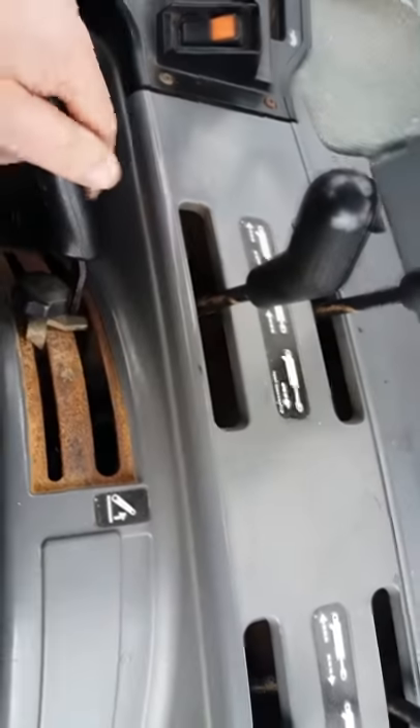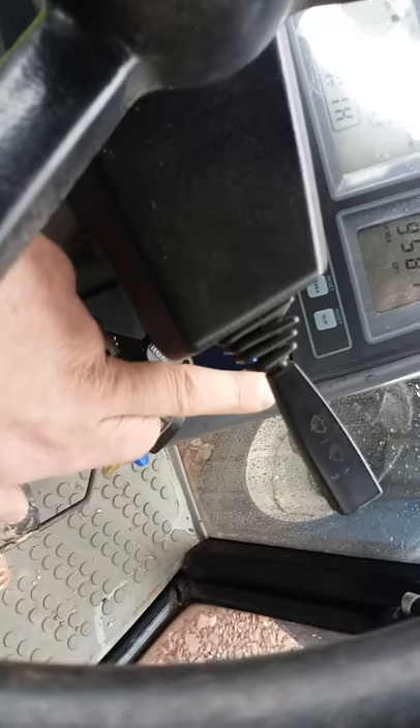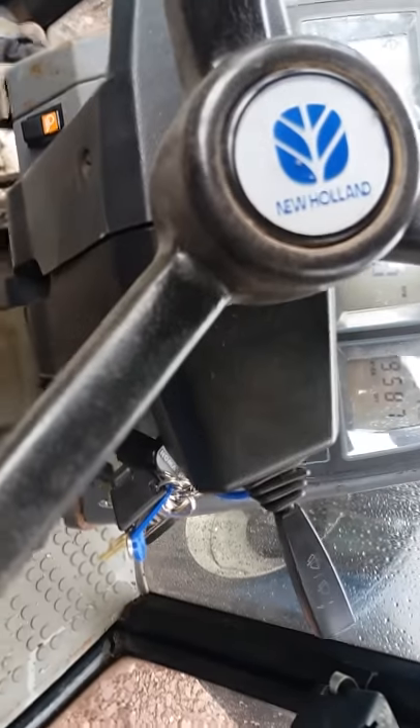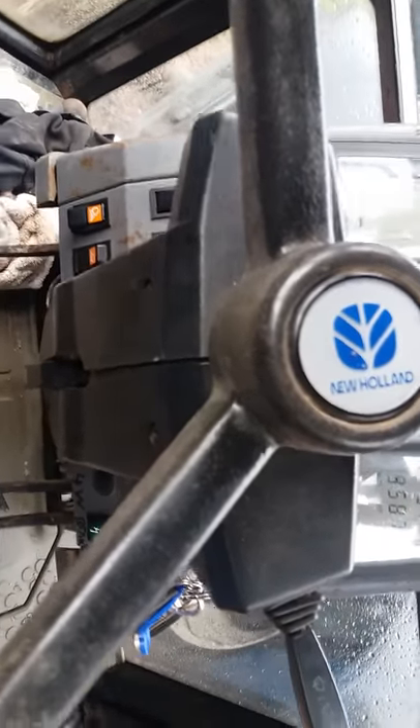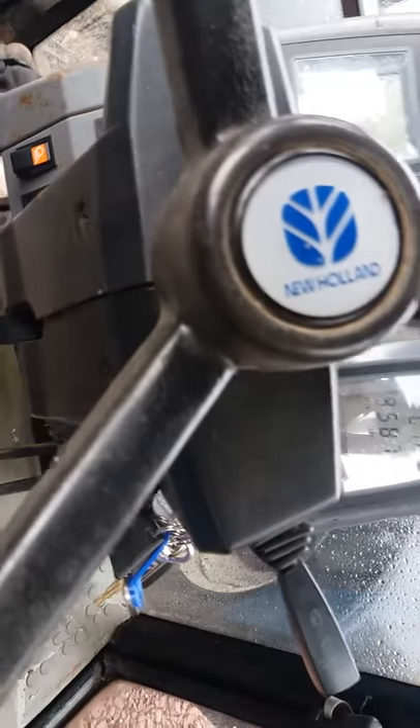You have all your different spool valves, lift arms, radio — the whole lot. There's a passenger seat, lights down here. Now the key — it's a New Holland key — but a lot of people don't realise there's a heater plug on a lot of these New Holland tractors. To use the heater plug, you turn the key backwards for maybe 60 seconds, then turn it back and let it go. The heater plug will come on automatically.